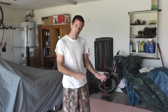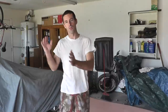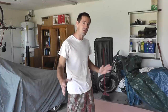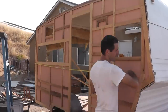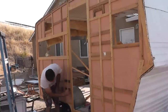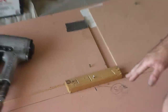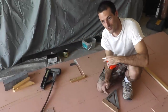I'm underway framing up this second wall, and one thing I'm trying to pay close attention to is how the dimensions of this wall compare to the first wall that I built. I want these two walls to be as similar as possible, if not identical. For instance, the overall length of my first wall is 150 and three-eighths inches with a height of 80 inches. I'll use these reference numbers in addition to the outline I traced to determine the final dimensions of the wall.